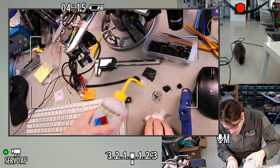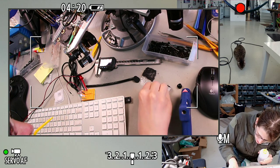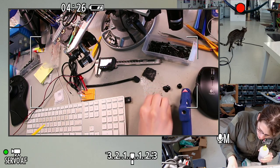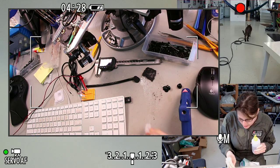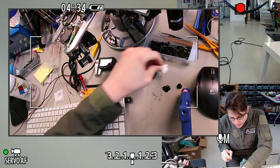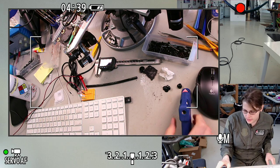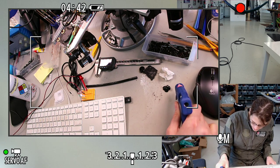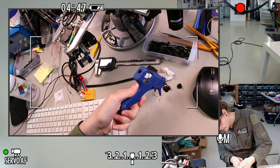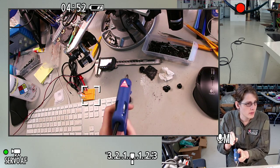So yeah, it's not necessarily as easy a cleanup as the other stuff. But anyway, this particular hot glue gun will give me a relatively small stream of this, so I'm going to put this on the circuit board just in the areas I need it for light blocking, and then hopefully not leave myself too little room for the plastic bracket that has to go on top. So yeah, this has been making little emoji puddles of very thick hot glue here. Let's put another one in.